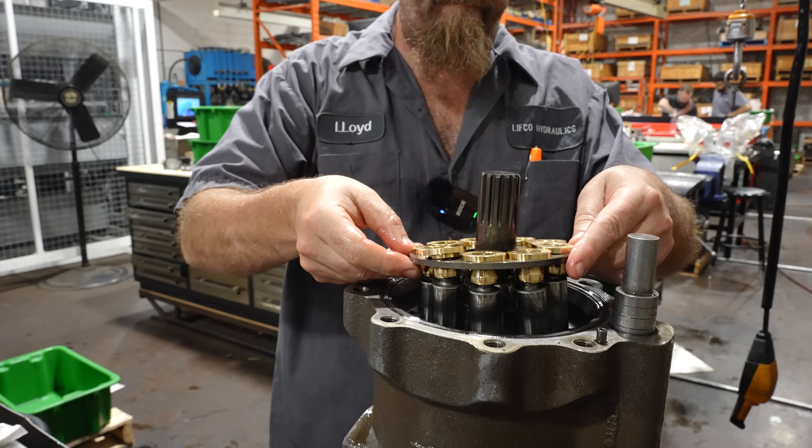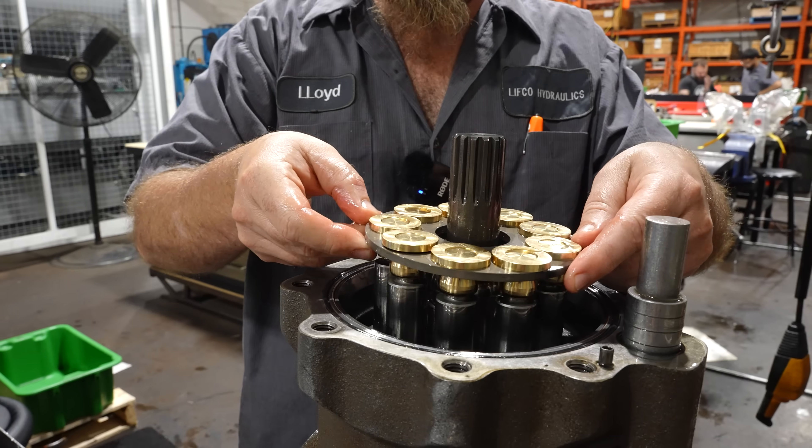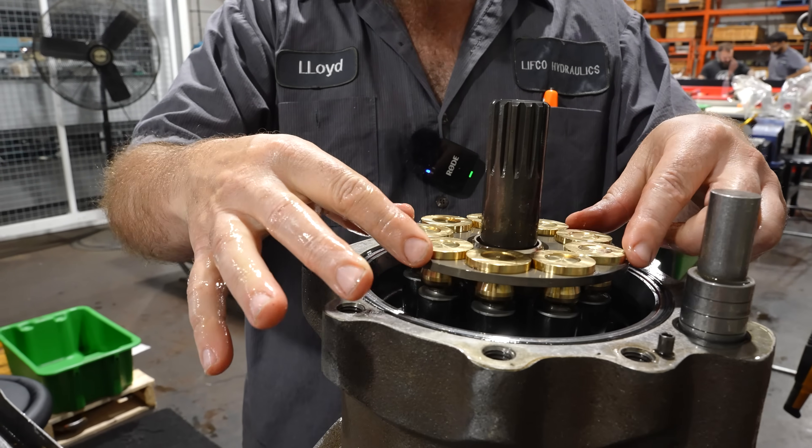They're a medium-duty pump. They're pretty simple. In an ideal world, we would love to just get the pump and put it right on the test stand — right from the customer, without us touching it at all. Unfortunately, what happens if the pump has exploded inside and it's a bunch of metal pieces? We would have to clean out our entire test stand, which takes about eight hours. We need to take a look at what we're putting onto the bench before we do so — open it up and actually make sure that everything is intact.